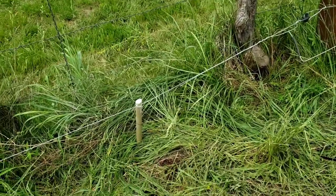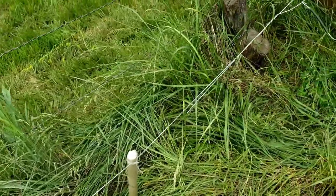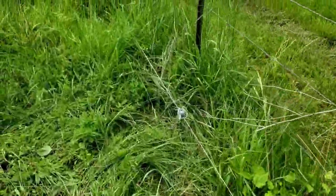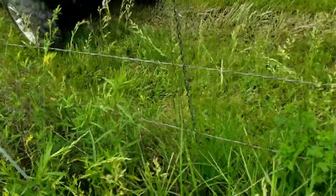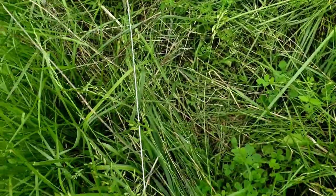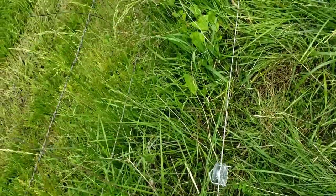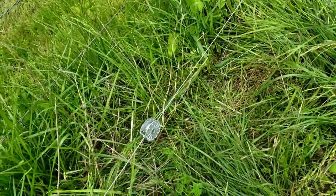What we've done here is use a fiberglass rod to pull the wire away from that fence so it doesn't get into the fence, and then it comes down here. We just use these little 3/8-inch fiberglass posts and the fence wire runs again a little bit below my boot top — I'll call it about 10 inches. Don't get it too low; it could even be 12 inches. You want animals to have to go over rather than under it, because if they push up on that wire when it's good and tight, it's going to dig into their hide.